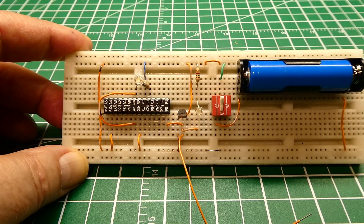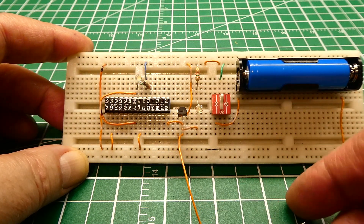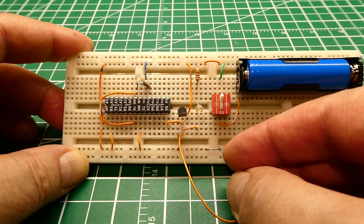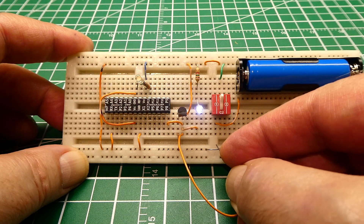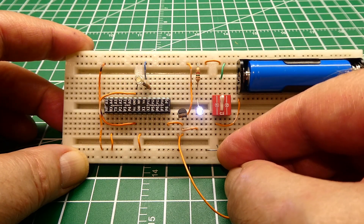The DS1233A-10, the 3.3 volt econo reset, is an open collector output that pulls down one of the GPIO pins of the microcontroller when the voltage drops below 2.88 volts — that's the low battery alarm. I can simulate that with this wire by grounding one of the GPIO pin inputs. When I ground it, you can see the LED comes on indicating a low battery alarm, and my flash rate increases.